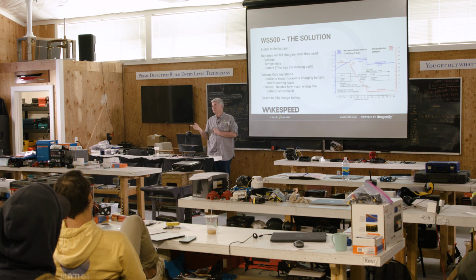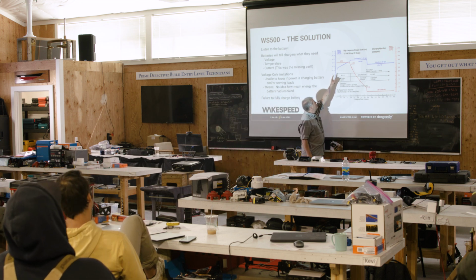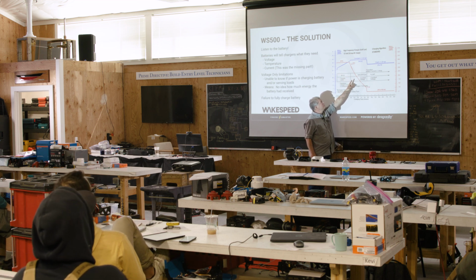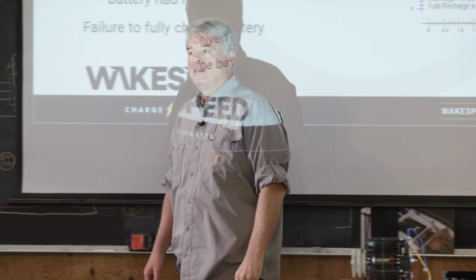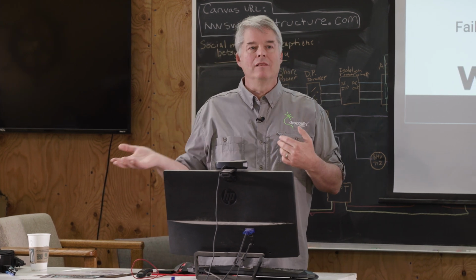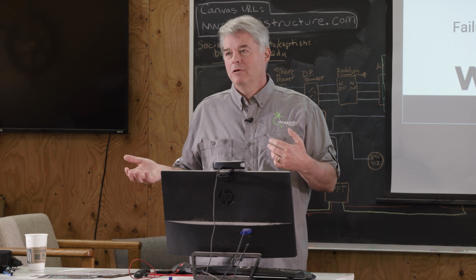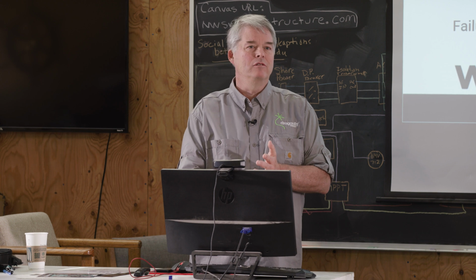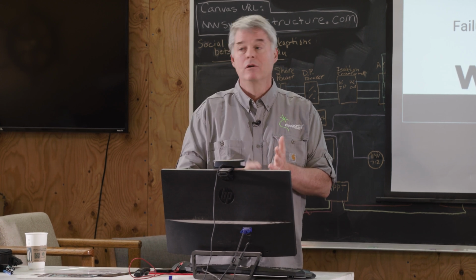So there are some products out there that say, hey, we'll just look at field drive. Because all the time we're doing this, we're going from like 100% field drive here, and then now we're at like 90%, 80%, 70, 60, 50, 40, 30, 20% field drive. So we'll let the customer install a threshold that says, when you get to that field drive, the battery's full. It's an indirect way. It's a proxy. It works great in the lab. Doesn't work in the real world because batteries age. So that 10% or that 20% drive is good today, but 3 months from now may not be good.